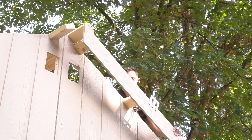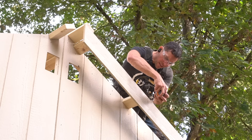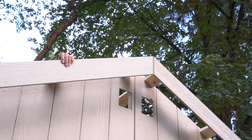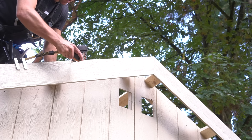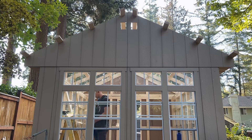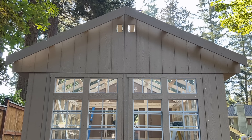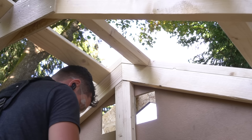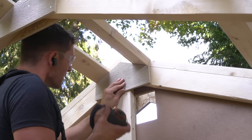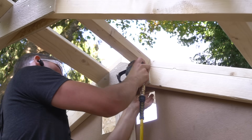Now that our framing is taken care of, we can finally move on to some trim — more specifically, our roofline face trim. This again comes at the exact lengths needed in order to avoid any cutting along the way. I recommend clamping it down first, aligning it at the very bottom, and then securing it as needed with a few nails. A nice tool to have when doing this is a palm nailer because you can get into some unique tight angles and avoid being on a tall ladder trying to swing a hammer above your head. After I take care of the fascia on the front side, I proceed to the back side, getting that fully installed, and then moving inside and installing the last couple of support brackets for our triangular wall panels.